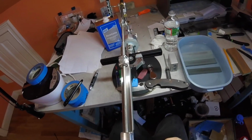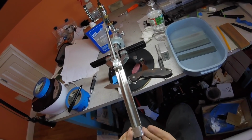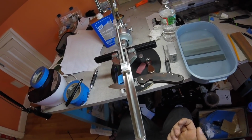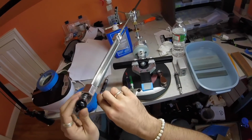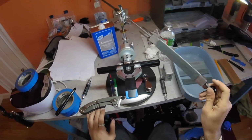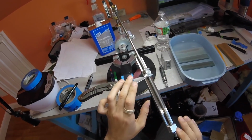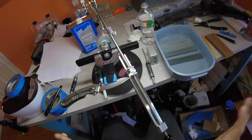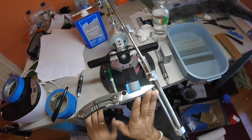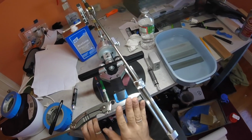Alright, and then once you've done 5, I want you to actually pick up the stone. Not pick it up, but reduce that pressure so it's not even the full weight of the stone. See how? Okay? 1, 2. And now, since we're on a coarse stone, or if you've ever used pressure using your knife, just whatever. I do this every sharpening. We've got the burr gone, but we used a coarse edge.